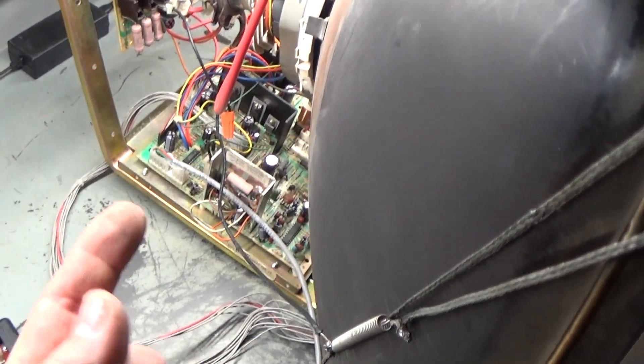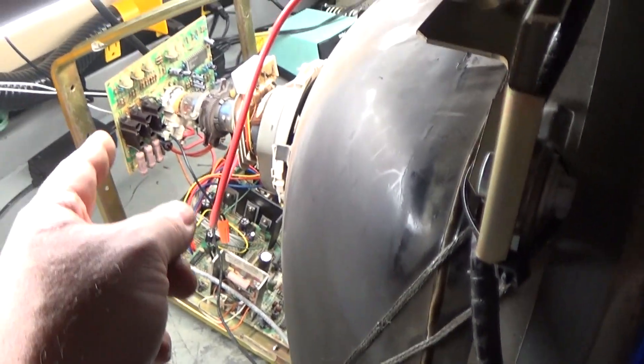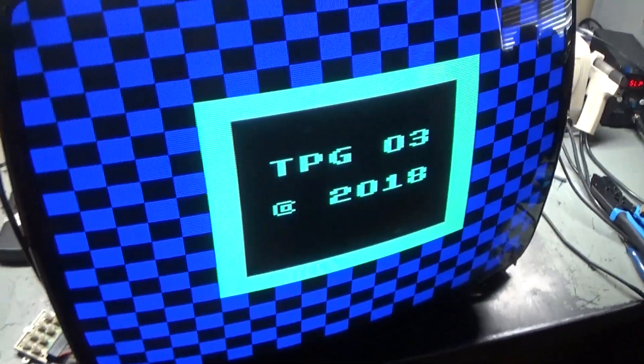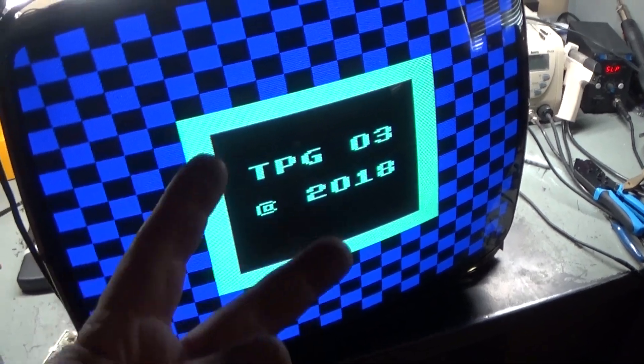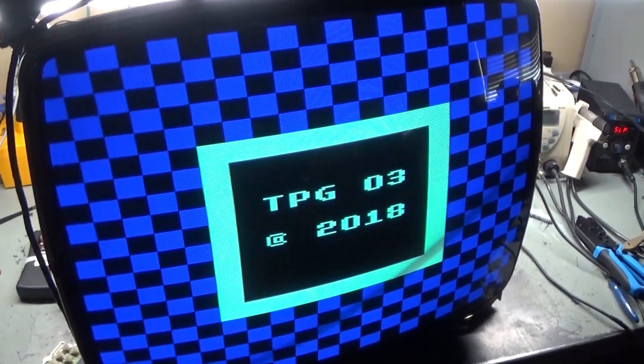So that's about it. Long story short: we had a failing flyback squealing and making all kinds of internal explosion noises — much more pronounced in person than on camera. And we had a bad vertical IC — wasn't shorted, wasn't open, everything read out exactly the same as my test chassis, but it just didn't work. Put a brand new one in — back in business. Full cap kit, full reflow, normal rebuild, neckboard rework — and it's ready to live again for a long time. Thanks for watching, hopefully you learned something. Stay tuned — got two 7500s to do after this one. Like, share, and subscribe, and we will see you next time.